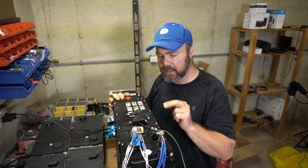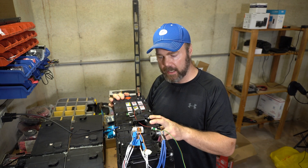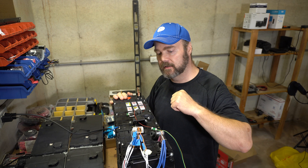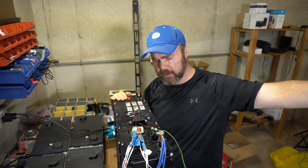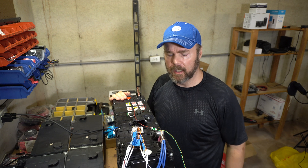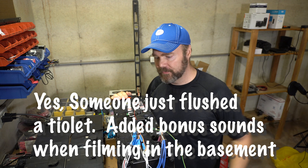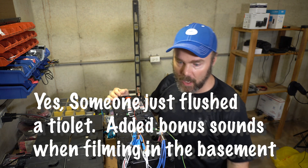I'm going to keep putting out videos. When I get the other two BMSs, I'll hook them up — one to each 24-volt battery. Then I'm going to make a 48-volt battery by putting two of those in series. Once I do that, I'll move everything from my workbench over to a dedicated area where I'll set up my battery rack. I also have an MPPT controller, and I'm waiting on fuses, battery disconnects, and more wiring to come in.